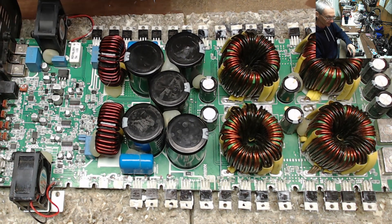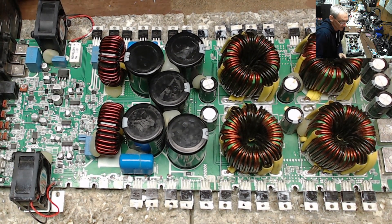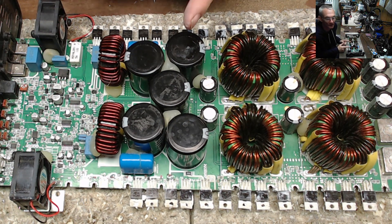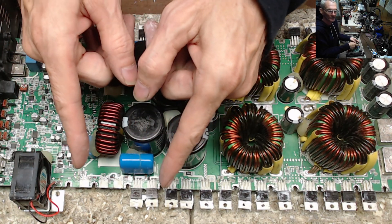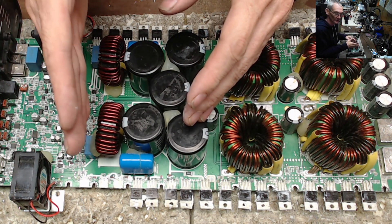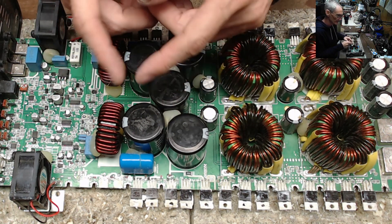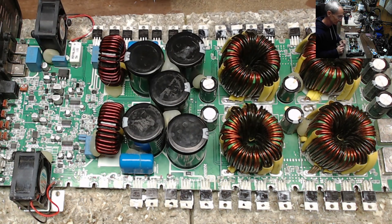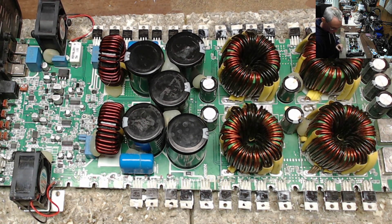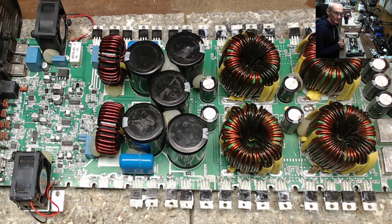I'll get that done and more than likely this amplifier will start right up. But what I really wanted to get across today was: double-check before you start an amp so you don't damage the work you've already done, because there could be an issue somewhere else on the board that isn't typical. It's rare to have a drain-to-source short without anything affecting the gate — but that's why I make videos like this, to share this information. Please be careful when you open one of these up and start checking values — discharge those rails, keep your fingers safe. These things hold a ton of current, so stay safe. We'll catch you on the next one; if you have any questions leave them down below. Thanks for watching.